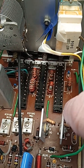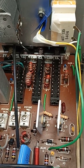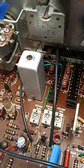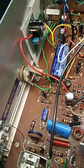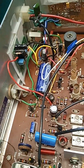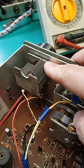With the circuit board out, you can wash these things out with spray cleaner — because I tried spraying cleaner inside and working it, then took it apart, and the cleaner did no good. So no cleaning from the outside; don't use them as they are, because they'll be destroyed from lack of lubrication. Take those out one at a time by sliding them the opposite direction. A hint: this coax from the TR relay to the front end of the receiver — originally they routed it out around the chassis. I shortened it, and that's a mistake. They routed it out there for a reason. Don't move it. It made the microphonics much worse because that cable is free to move.